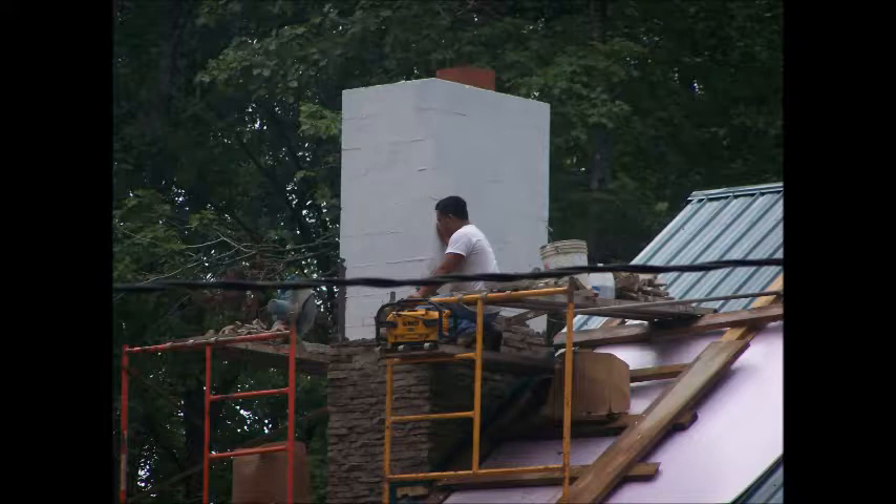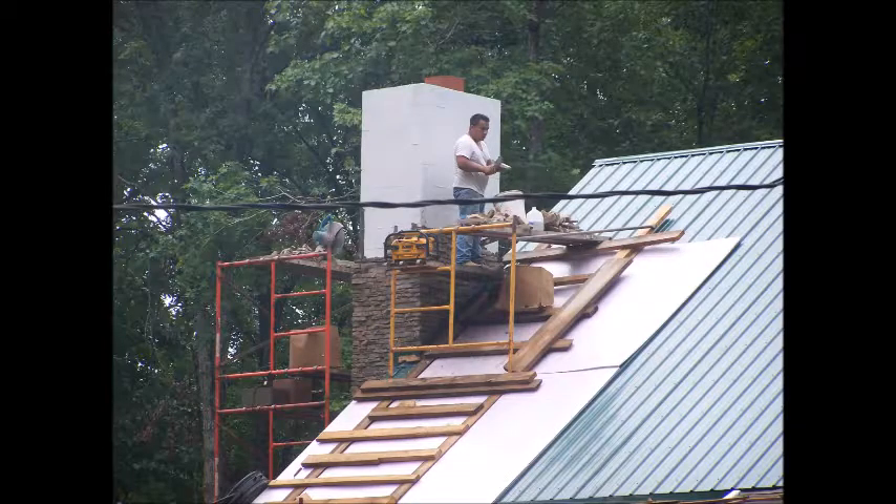While we catch up on the inside with the framing, wire, and masonry work, the masons have moved outside. They're bringing up the stacked stone and up onto the roof. We've got the roof laid out with inch-and-a-half rigid insulation to protect the roof from anything that may fall and hit the hunter green metal roofing. The insulation is all the way down to the bottom, the plywood is covering it, and we have a ladder made that's holding up. There are some screws through the roofing, but we're careful not to oblong the holes or make it so it leaks.